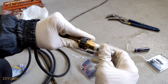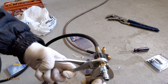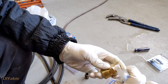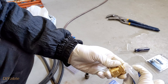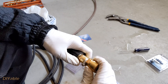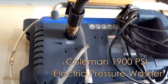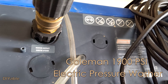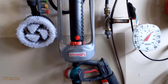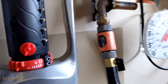We have this part fixed. The rest is very easy — we put this quick connect and screw it on. You do need some Teflon tape. Here's a DIY tip I want to share: how much Teflon tape do you need? Usually I wrap it three times — that's good enough. This is the female part of the quick connect; same thing, wrap it with Teflon tape on the threads and tighten it.